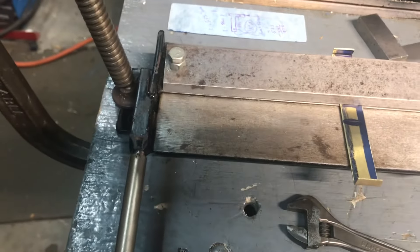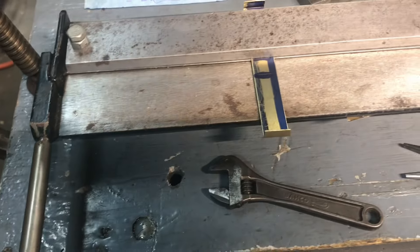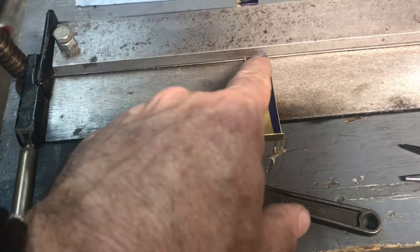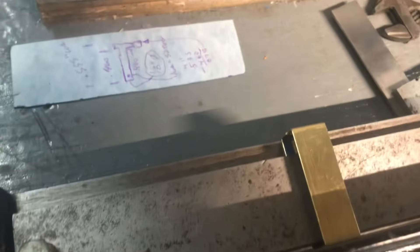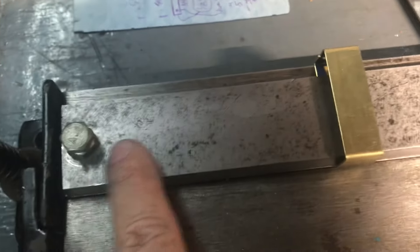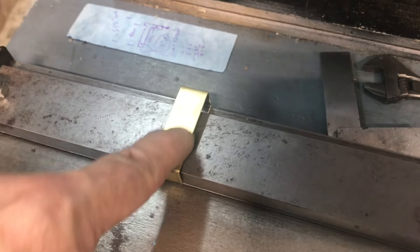The first one on the Binford 3-in-1 machine was a little tricky, so I broke out a small bender I got from a friend — a Harbor Freight unit about 18 inches long, great size for small stuff. I made the end bends, lined it up with a square for the middle bend, and the result is very clean. I was able to get the other side done after unbolting and lifting — I'm really pleased with how that came out, though there'll be some fine-tuning.